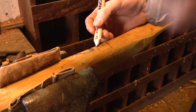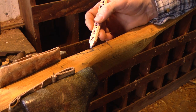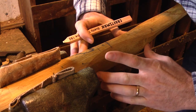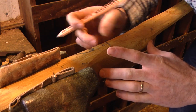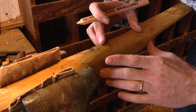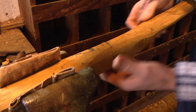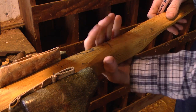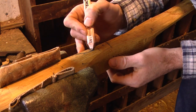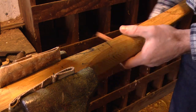I like to come about an inch and a quarter above the center to cut in my arrow shelf right there, and then your handle obviously is kind of right in here, so your handle favors towards the bottom limb just a little bit. That's why that bottom limb's a little bit shorter than the top. So we'll narrow this up a little bit, make it a little bit more comfortable for our hands, and then cut this arrow shelf in there and finish off the handle section.